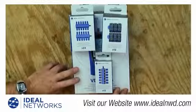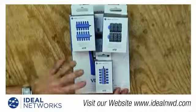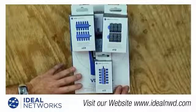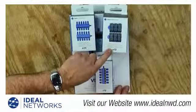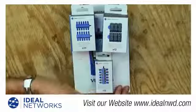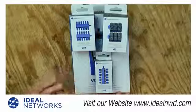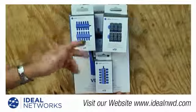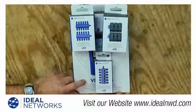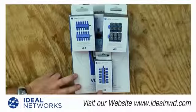Here's a close-up of the VDV Pro in its box along with all the identifiers and remotes you can order separately. The remotes and identifiers are all à la carte. The tester always comes with one remote for testing coax, phone, or data cabling. There are also 12 extra data remotes, labeled 1 through 12. You can put the different remotes into different outlets in different parts of the room or building, go back to the panel, and test each cable separately to identify which remote is on the end. There are also 12 coaxial remotes, very handy for testing and tracing coaxial cables.